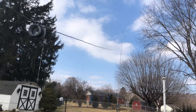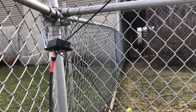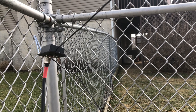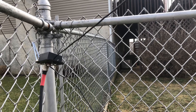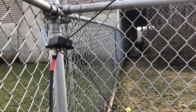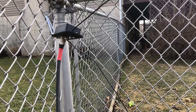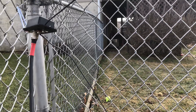You can see it's very loose here. So I think if I stretched it out properly in a sloper position, or maybe an inverted V up and over a tree with the proper length, the SWRs would be a little lower. Or if I was an extra, I think in the lower portion of 80 meters it would work great, comparable to 75. So this is the MFJ 1982 Lima Papa, 30 watt capable, EFED antenna, 80 through 10 meters. There's the 49 to 1 balun — I'm feeding it with 100 foot of LMR-400, and like I said, this is the counterpoise at 15 feet.